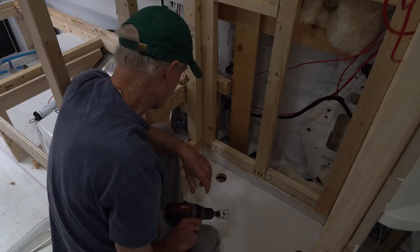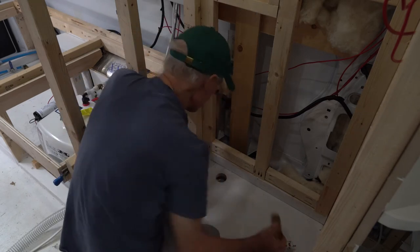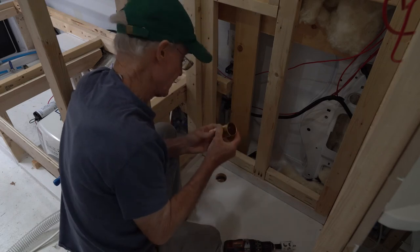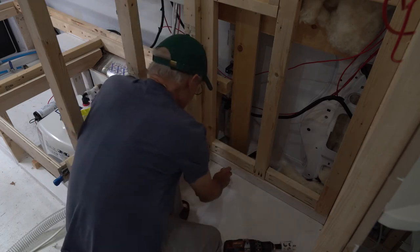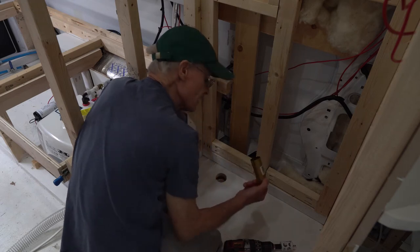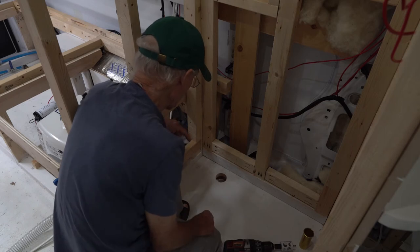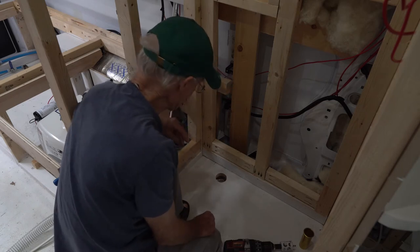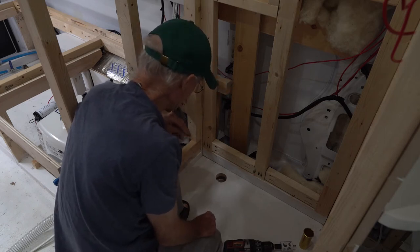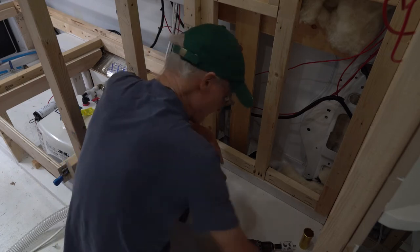Well, that's a hole drilled through the van. Let's see if the tube fits through. Yeah, it does. So I think I'll get a file. File the edges smooth and put some anti-rust paint on the cut. Let it dry.